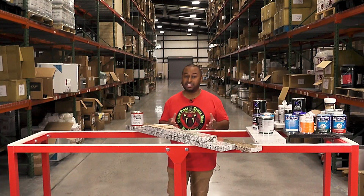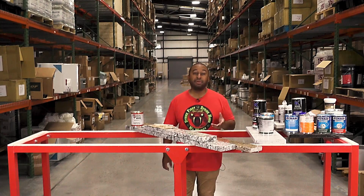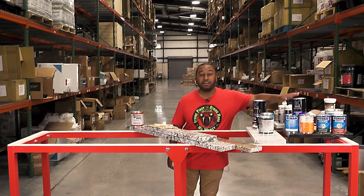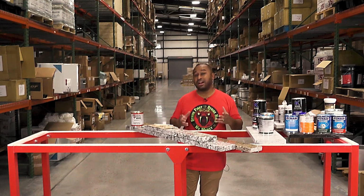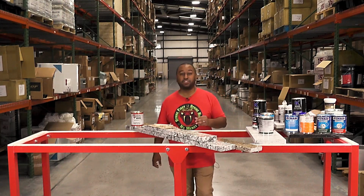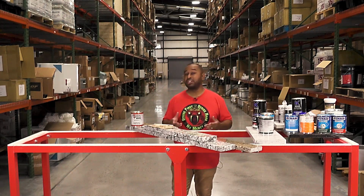When it comes to polyester, there are several choices. Stone Shield, as we just saw, K-Bond, Tenax, and Akemi are other brands that are great. They are similar in the way they work and they have common properties. Polyester, once again, is a great choice for repairs and matching colors to a particular stone.